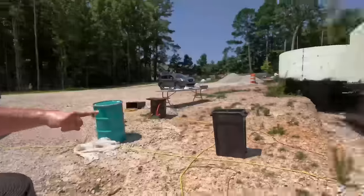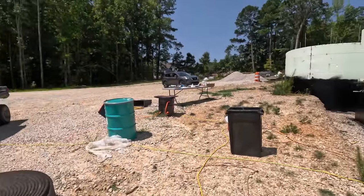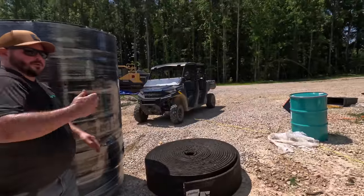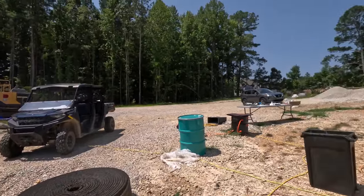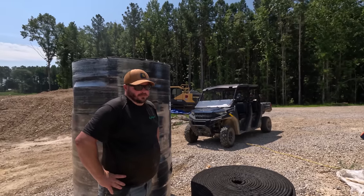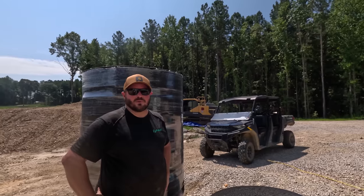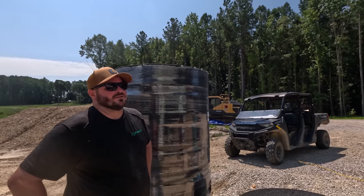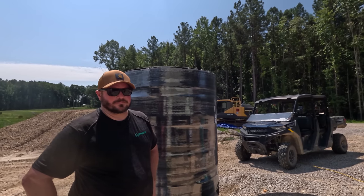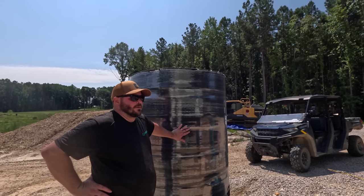If you're having trouble fitting under there, you want your top flush and it runs out a little bit on the bottom. The top needs to be against your foundation, so it's not pulled out during backfill. Every now and then just put one at the top, one at the bottom. For the most part, I think it's going to be adhered better than fasteners, because typically with fasteners they're doing about every 4 feet, 4 to 6 feet. You're doing it every 2 feet with a screw. I think we're going to be pretty good.